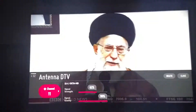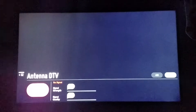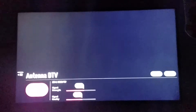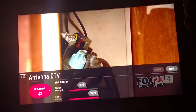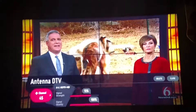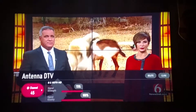Channel 11 also just had almost 100% signal quality — before, those were all below 70. Channel 23 is at 100%, and I believe it was at 100% on the other antenna too, but the other antenna was running a booster and this one's not. That shows just how much better this is, and a lot of that is due to the reflector I put on it — what they call hardware cloth — which needs to be about four inches from the actual element.